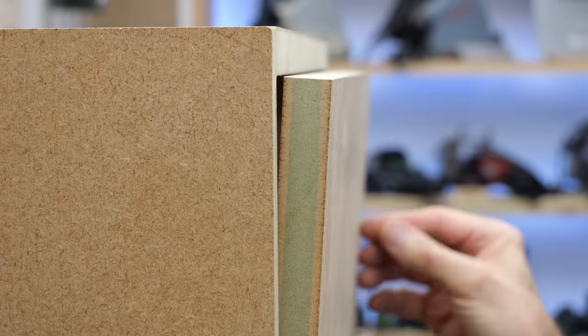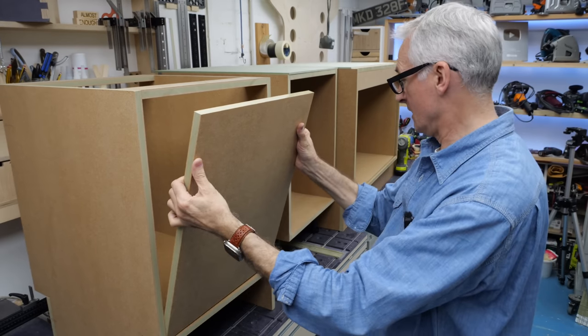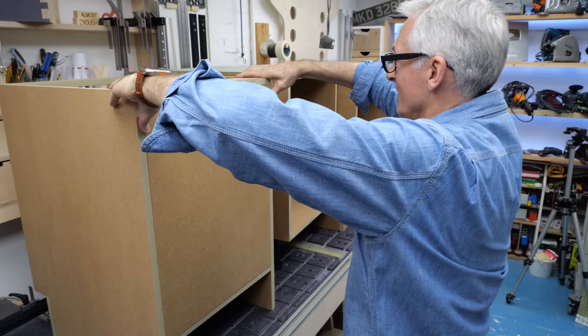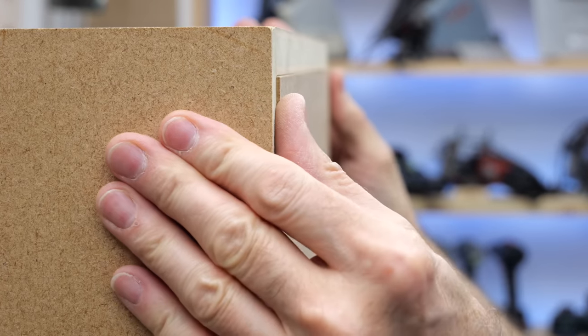It fits within the carcass sides and base, and this would normally be secured with hidden fixings like dowels or dominoes and fitted during the actual cabinet carcass construction. A solid back makes for a robust, if heavier, cabinet, but it can be a nuisance when it comes to drilling through it for services like water or waste pipes in a kitchen or bathroom.